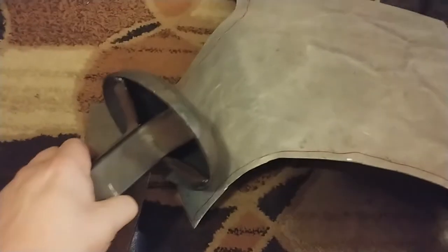So now the thing we've got to do is flare the tail end up so it comes out, so you know it doesn't stab you in your lower back. And then we're going to roll the bottom edges. Once we roll the bottom edges, if we feel like we're strong with that, we're going to roll the arms and then the top. So for now, we've got to flare these up. We're going to be using the forming stake upside down in order to get those tapered up.